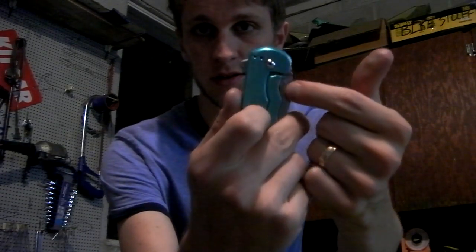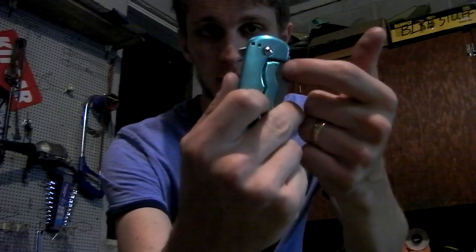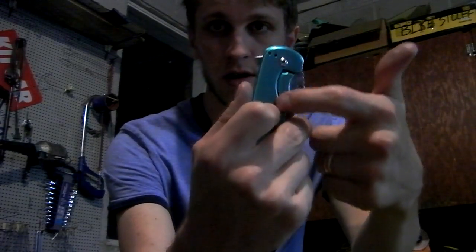Alright, I wasn't going to show this, but it was so awesome, I just had to show it. So remember on the green one, the fractured detent ball, of course you remember, you just saw it. To me it was like 2 hours ago. But, so I punched it out. I put a ceramic detent ball in, not in the same hole location. You see the hole right there? Not in there, but a little bit over. I put it in a different location, but still on the exact same arc.